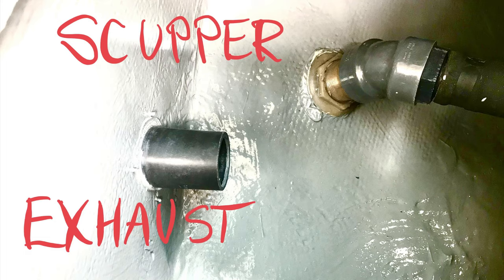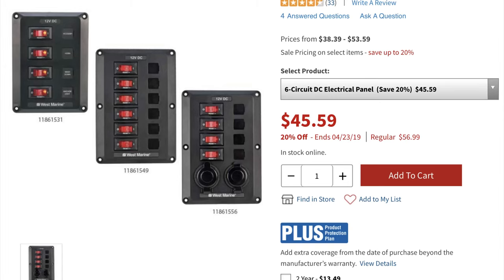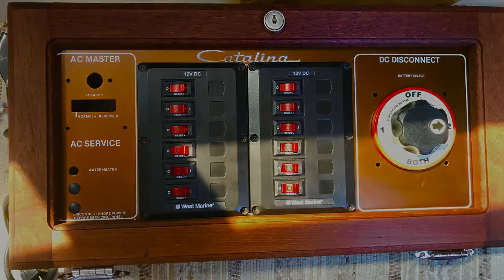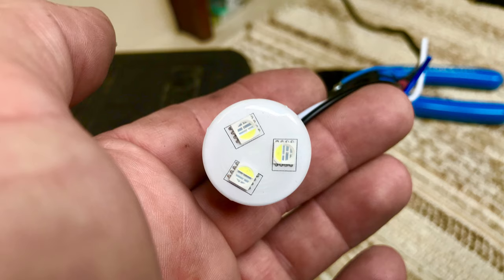I changed the bilge pump output and exhaust output fitting. Then onto the electrics and distribution panel. I cut a new hole in the liner to run new wires, fitted a bus bar for the ground, and added a little strap to keep the door from opening too far and trashing the hinges. I found these actual breaker switch panels — resettable, lit when on — made by Blue Sea Systems but re-labeled and sold by West Marine. I cut the panel out, fit them up, and they fit perfectly with the logo still showing. They take standard Blue Sea Systems labels but aren't backlit, hence the price. So I bought a little three-way LED — red, green, or blue depending on how you wire it — and wired it up green. First choice worked great.